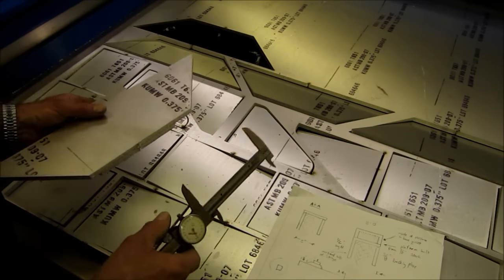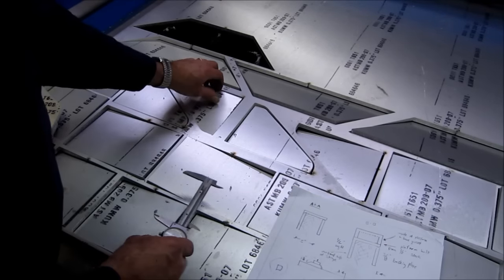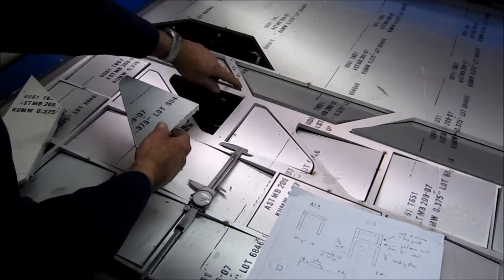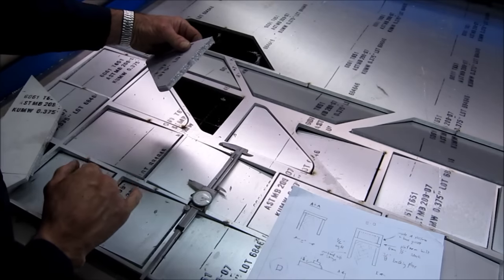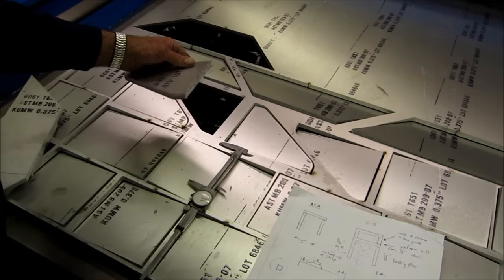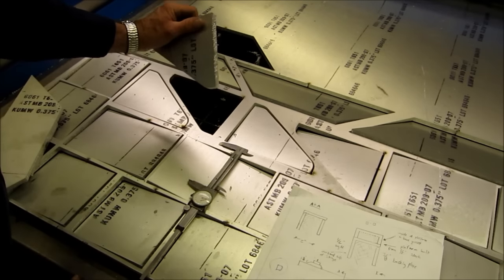We didn't have any fails there. We did have a fail or two on the tripping of the torch. This one part right here, the pierce was right here at the corner, and it came in, and I didn't notice it till I got down in this area right here, and then I stopped it, lifted it up, and cleared the little BB ball on it, and that's all it was, and it was just interfering with the flow there.